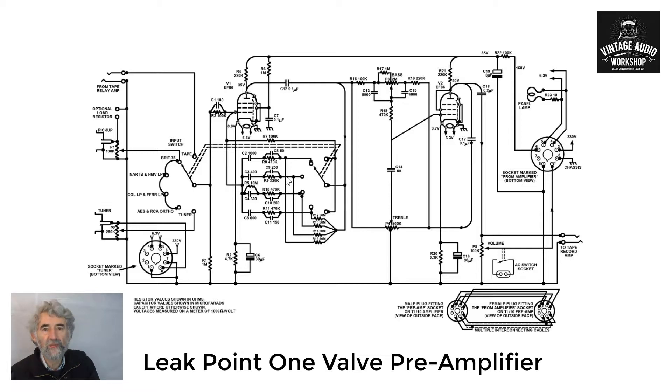The switching is a bit complex. The input valve will be designed for minimum noise or close to it. So we have a megaohm in the screen and 220k in the anode — approximately a 5 to 1 ratio. For maximum signal to noise you would actually have a 10 to 1 ratio, i.e. that would be 2.2 megs, but you lose gain doing that though.